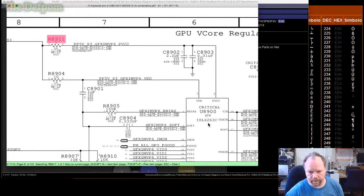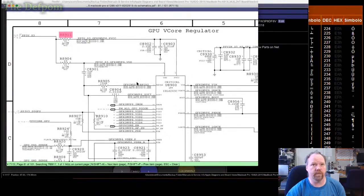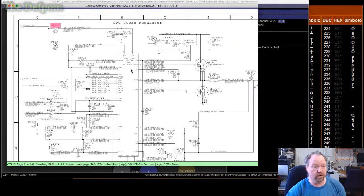Okay. Your ASD will fail, yes, for the graphics. That's right, it will fail for the graphics. But that's the only thing it will fail on. You know, it's a trade-off between replacing the GPU, which will fail again, and just disabling it and moving on, because this works. Okay, so hopefully you're all happy with that. You can see what it's doing.